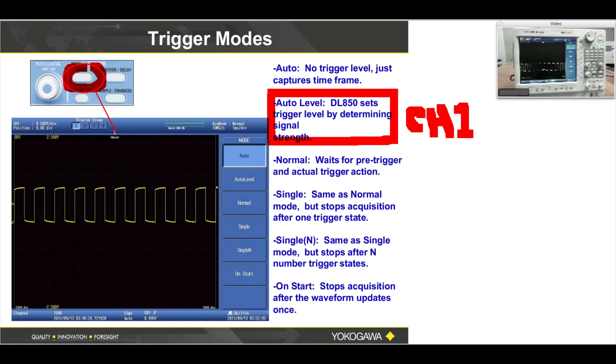We're more likely to find your waveform and we'll set a level for you. Over here on my screen, on the left side, there's the letter T. If you look at your DL850, you should have the letter T there — some of you will not. Your waveform may be on another channel than your trigger level.